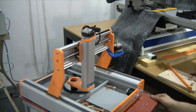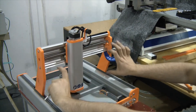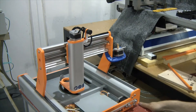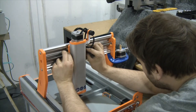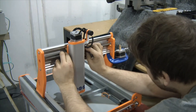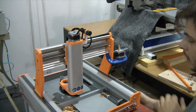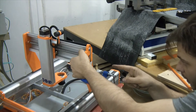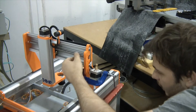You can be very precise about this and make sure it's exactly the same on either side in terms of its height. For now I'm just illustrating the process. So what I can do is physically check and try to optimize. When I rock the ball screw, it's centred over the hole. I can even look in here and check that I'm roughly centred.